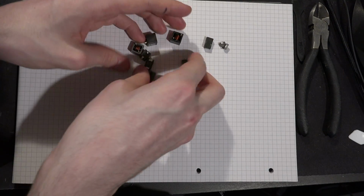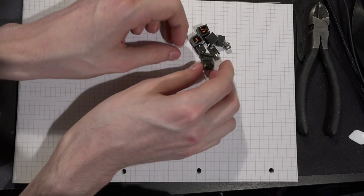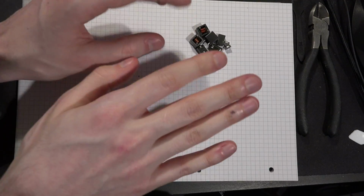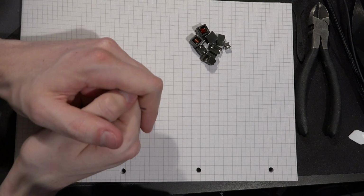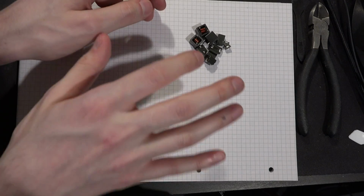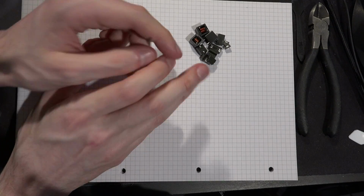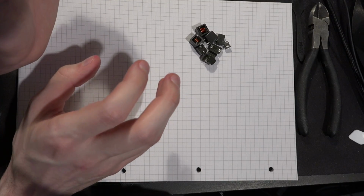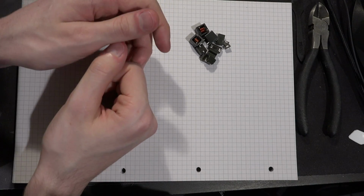And the other thing now, let's talk about why the inductors actually vibrate. So we have the construction part down, right? The two-piece inductors are more likely to work themselves loose, so the core is more likely to vibrate around. Now, the reason they're actually going to vibrate is because of the way inductors are used, especially on GPUs: you have massive varying currents going through them.